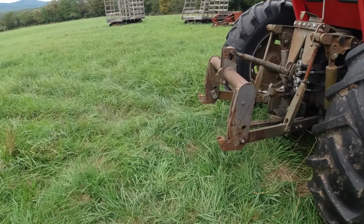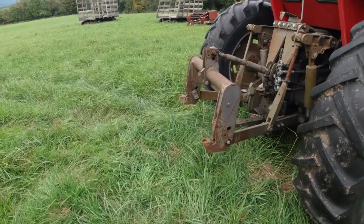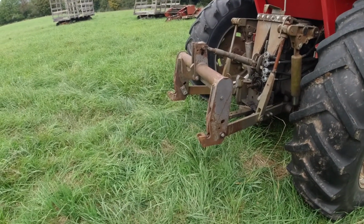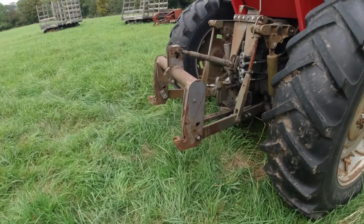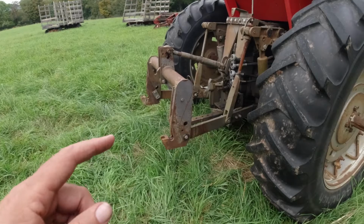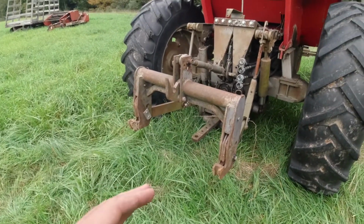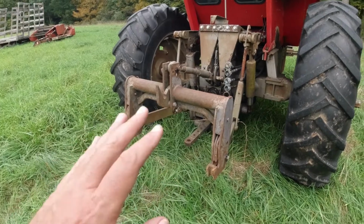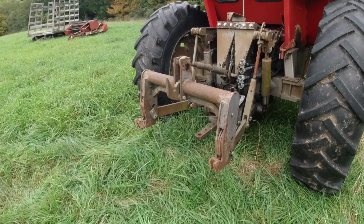rotary cutter. And the idea there is it would be something I could run on this tractor and my John Deere. And on the John Deere, there's a limit to how much weight you can put on the tongue, and obviously a 15 foot bush hog is too heavy and there's not enough horsepower. But on a 10 foot bush hog, I do have enough horsepower.